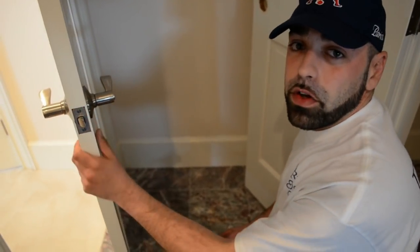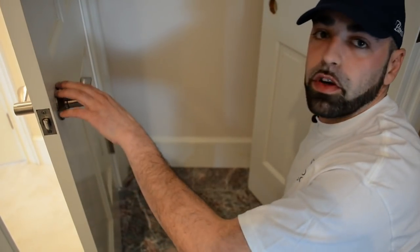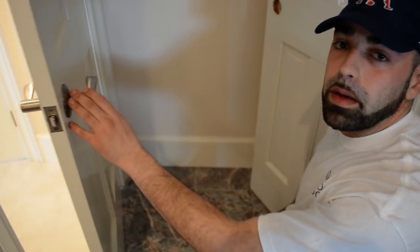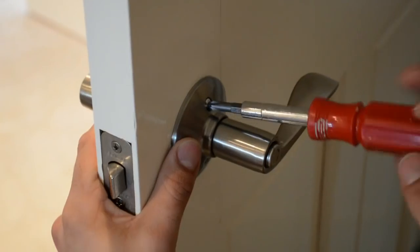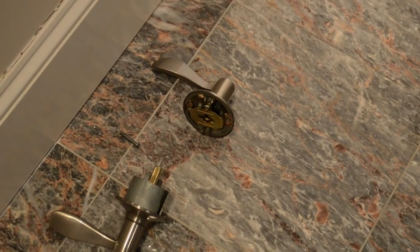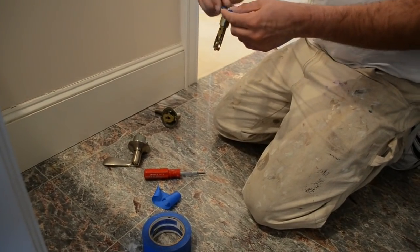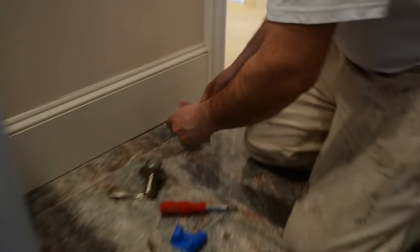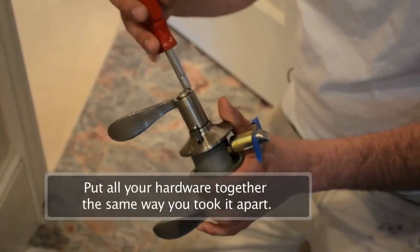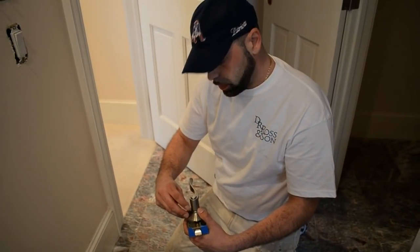Now take all the hardware off of your doors. It's really not that hard. It helps give a cleaner finish, lets all the grain and the wood flow together, no brush marks, and there's no risk of getting any paint on any of your hardware. If you have a lot of these to do, you might be tempted to use a power drill, but with a nice finish like this it's better to use a hand screwdriver. It helps eliminate any jumping of your screw tip so you don't scratch any of the hardware, because you want it to go on exactly as it came off. Put a couple pieces of tape over the screws, fold them over so they can't jump out, then put everything back together the way that you took it apart. That way you have no risk of losing any of the important things — nothing worse than finishing the job and being one screw short.